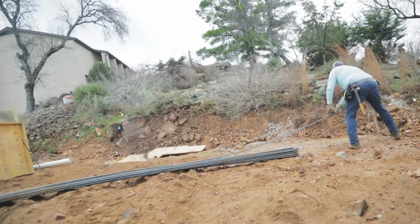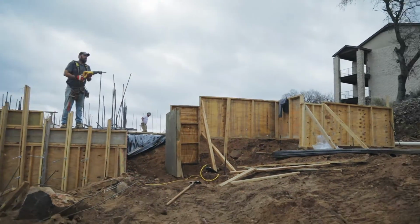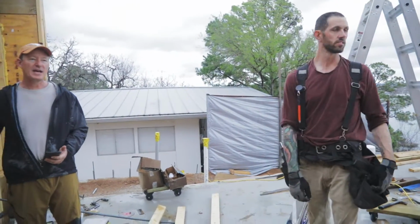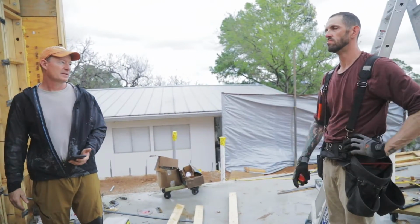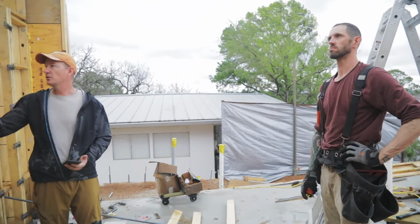This exterior shell, and then get it out of the way. And then we also have to clean the slab off, technically, so that'll take half a day. Take this stuff down on this side of it. We're out of the way, and then all this interior stuff has got to stay for two, three weeks anyhow. Really almost a month for a full concrete cure, because it's got to hold all this weight.